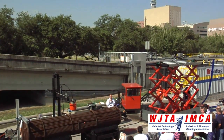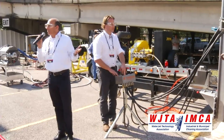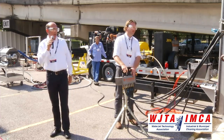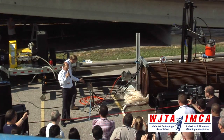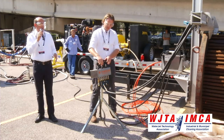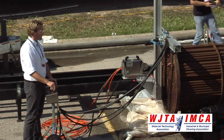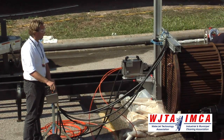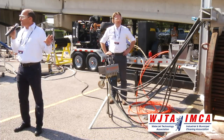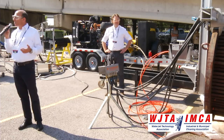As they change the hoses, I'll take you to the other side where we have a new flexible lance cleaner. The pieces weigh about 20 pounds each, so one guy can easily take three parts to the exchanger, clamp it on a shell flange, and then run the machine. You've got a control here which is pneumatic, so we can feed the lances in and bring them back in, and then we can index it up and down and left and right. The good thing about this tool is that you have only three pieces — four with the remote control — and a single guy can set this up in ten minutes on an exchanger. You can bring these parts in a small pickup truck, or even with your pump, bring it to a job site and do all the work by yourself.